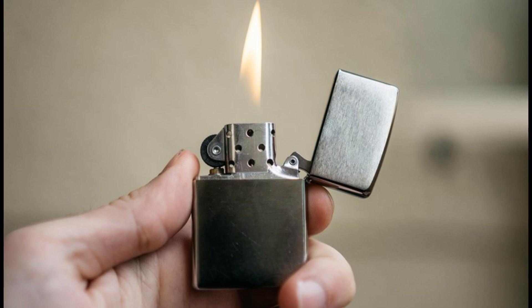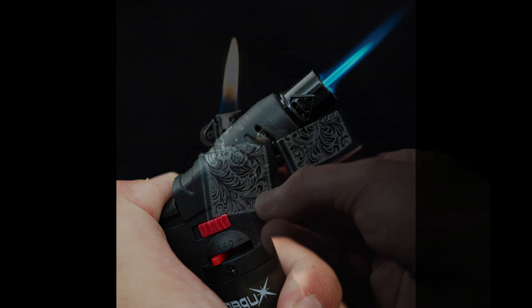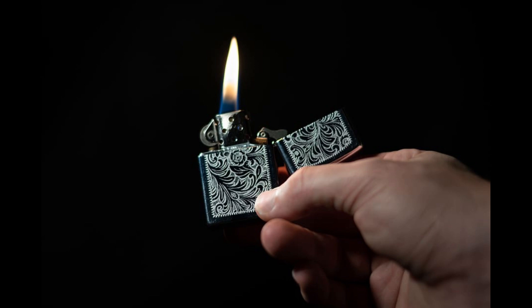Years ago, after several failures, I learned about flame treating my plastics. Flame treatment is a surface preparation technique where you briefly expose polyethylene to a flame to improve adhesion. I'm not going to try to even explain what happens at a molecular level, but the results have been pretty great.